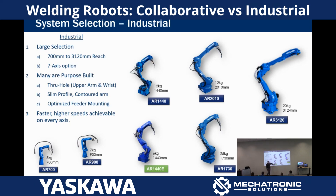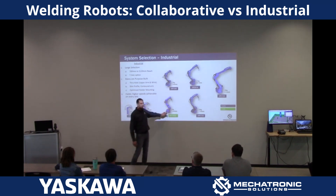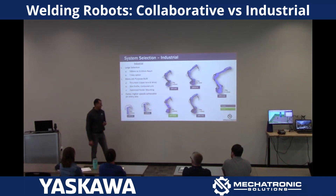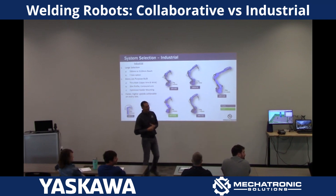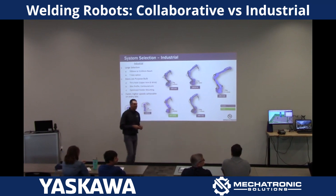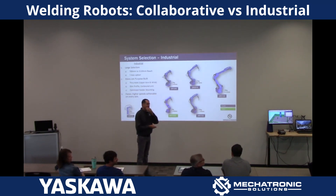There's also a seven-axis option on the 1440 — it has an extra axis in the lower arm. I got to use one in Ohio, and I'm surprised we don't sell more of them, because you can just lay that arm over and it opens up a whole new realm of being able to manipulate around a part that has a lot of structure to it. One customer in the territory uses those when needed because they have three weld robots welding on the same part — you can eliminate the upper arm interference and get two torches in a very tight space.